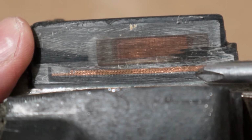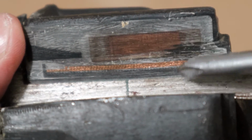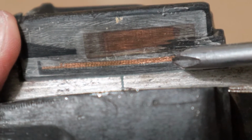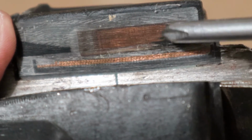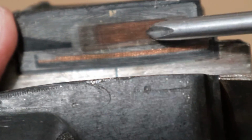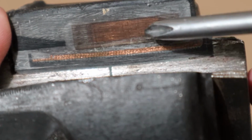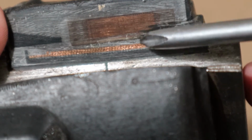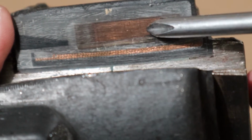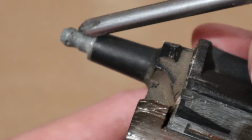And so once we get electricity through our primary windings and we make a magnetic field around this metal or steel armature, that magnetic field saturates the secondary windings as well. And when something triggers the voltage or the current to stop flowing in our primary circuit, we get a sudden loss of our magnetic field, which kind of acts like a magnet passing by the coil of wires. And by Faraday's law, we have some amperage induced into the secondary windings. Now, there's a ratio between the two, and that ratio determines how much it steps up or steps down. And in this case, it's way more, so we're going to get a step up in our voltage, and then the only spot for that voltage to go is on our high tension post here, which is going to go to our spark plug wires.